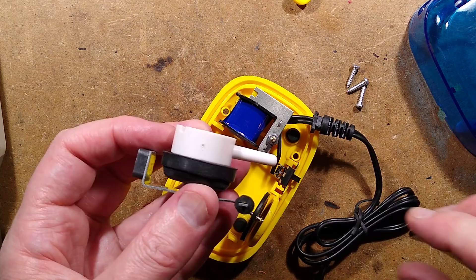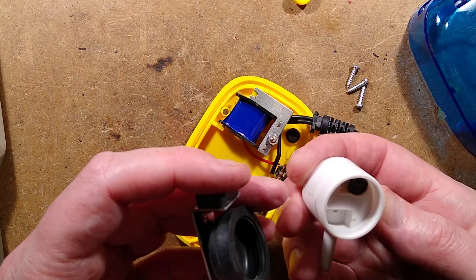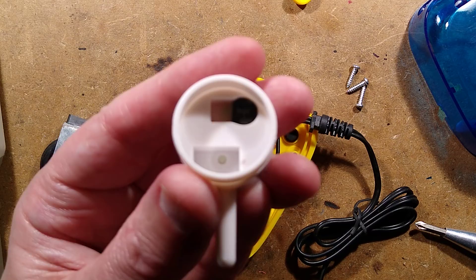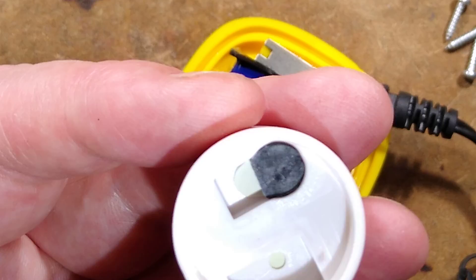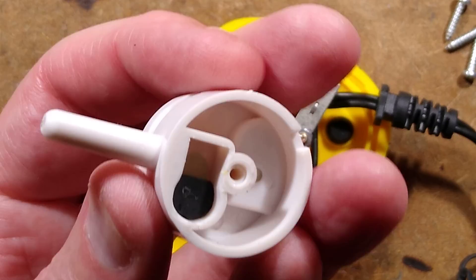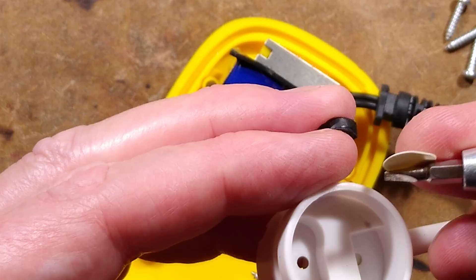That's quite interesting. I'll lift this up — here it comes. So we've got a diaphragm at the back, a little chamber, and there is the one-way valve. There are two one-way valves, and they're little bungs. Let me get you closer — I'll focus on this and zoom in. Can you see the little flap there? They've just jammed it in with a rubber plate. Likewise on the other side you can see the other flap, also just trapped in — a very simple way of making things.